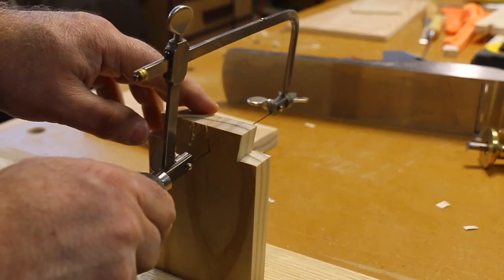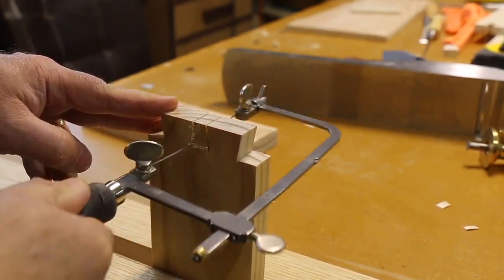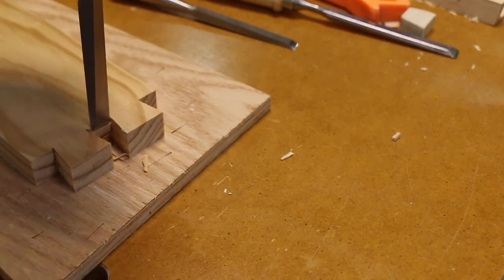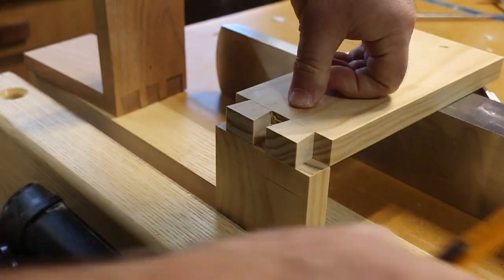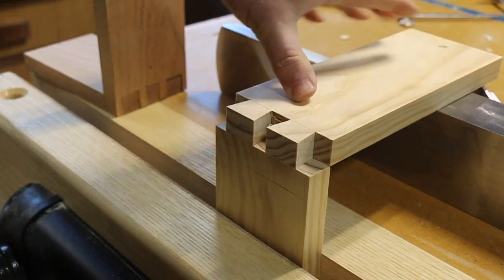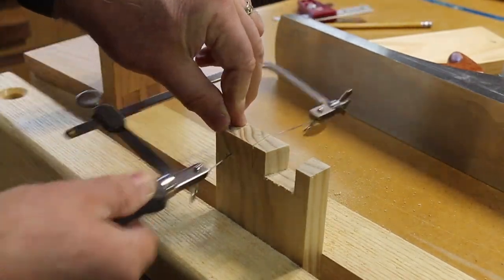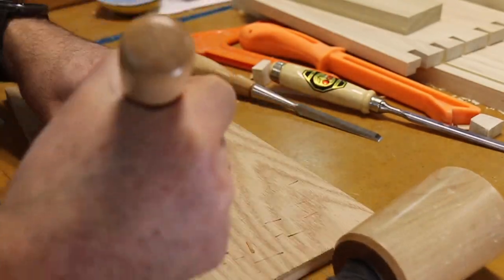The rest of the process is pretty similar — I'll go through this pretty quick. Now that I've done the cutting on the bandsaw, everything else is handwork. It's cleaning out the waste on the tails, cutting out the bulk of it with a saw, and then using a chisel to cut through and clean up that edge. Then it's a matter of lining up the tailboard on your pinboard, making the marks. I use a knife here to give myself a nice clean edge to cut to. Then you cut down with your dovetail saw and clean out the waste with your coping saw.